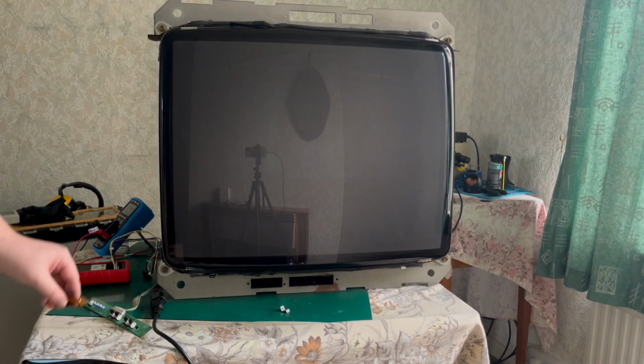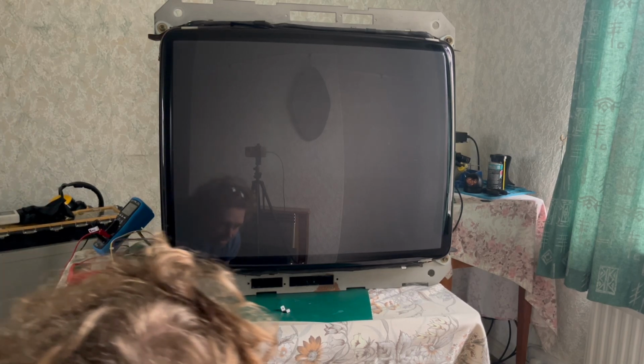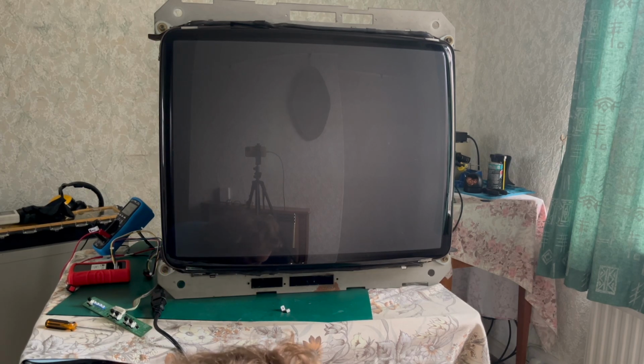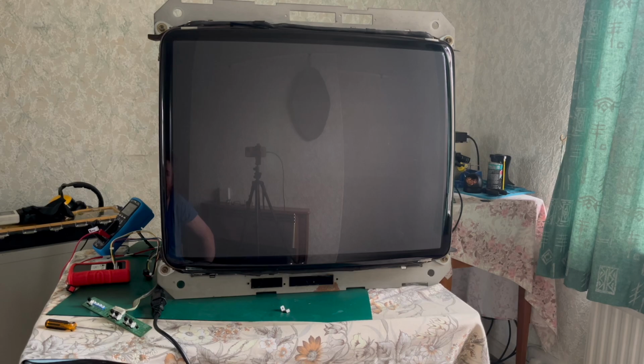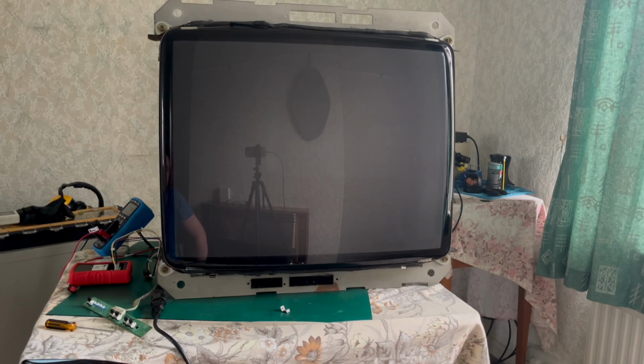I've got the remote board connected up, got a screwdriver, I've got the flyback turned down. We've got neck, we've got DAG ground, got the anode cup plugged in. I think I'm as ready as I'll ever be to test this. I always doubt myself, but fingers crossed this goes right and not bang. So what I'll do is I'll just crouch down, probably see me here, apologies for that. I'm going to plug it into the step down transformer. And turn on the test pattern generator, that would help. And yeah, let's give it a go and hope for the best, I guess.